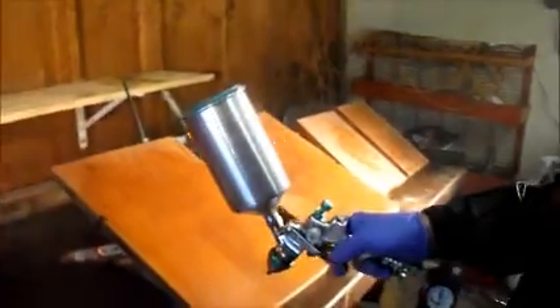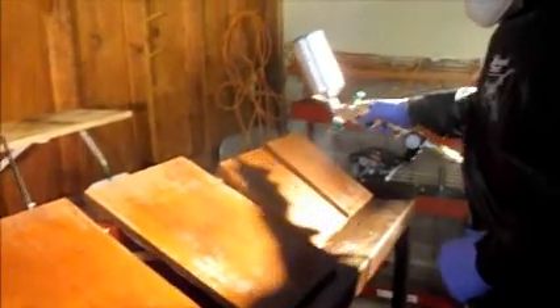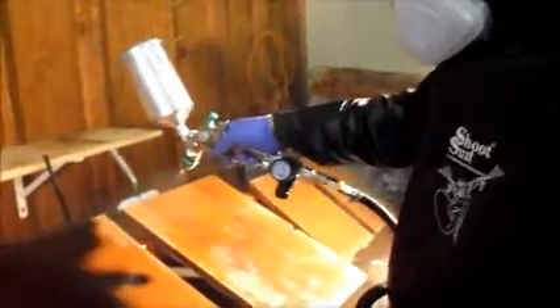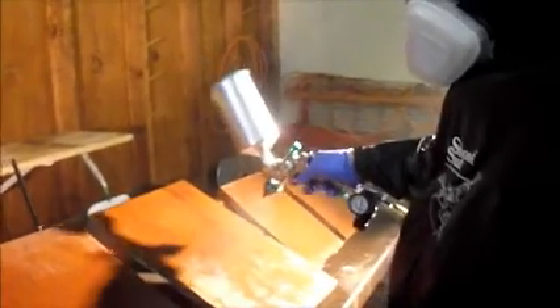You don't want the barrier in between to not get the product. This is a two-stage base coat and top coat super hydrophobic spray, and we're testing it on some concrete today. He's going to dry the forms with a small heat gun because the temperature isn't quite warm enough today to get this stuff to set up quick.